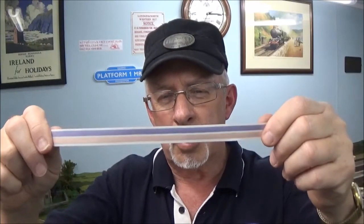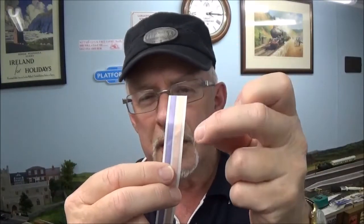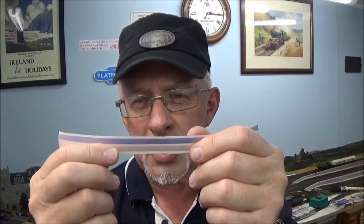There's also something I've seen mentioned a bit lately, and that's copper foil tape. The purple strip on here is still copper. This is actually recommended for doll's houses, and this system is really designed to be used with a brad pushed through each track to make electrical contact. Personally, I don't like that sort of electrical contact. I have used this — I've stripped off the insulating material on top and scraped the copper foil to give a good surface, and I've soldered to it. It's apparently supposed to carry 5 amps at 12 volts. However, once you start soldering, you've got to be really quick because you can loosen the glue and it comes away quite easily. If I was to use this under my layout, I reckon I'd be coming back in 12 months trying to stick it all up again.